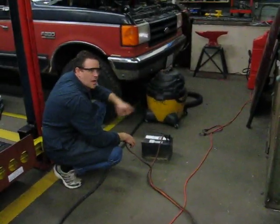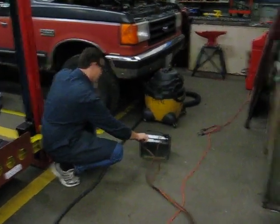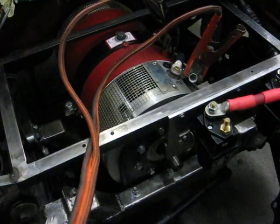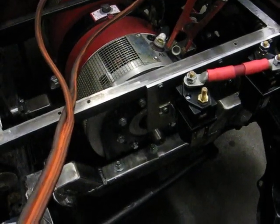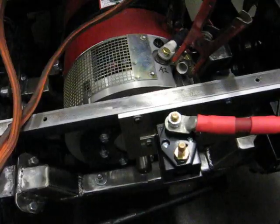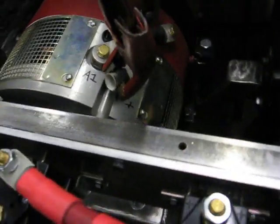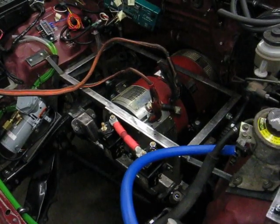Mr. Cowan, are you ready? We activate the motor and there we go — we're spinning up. We've bench tested the motor and we've got clockwise rotation at the commutator end. So that means the positive is on A2, and that should help us in figuring out how the forward and reversing contactors are going to wire up.